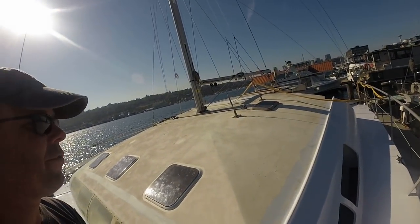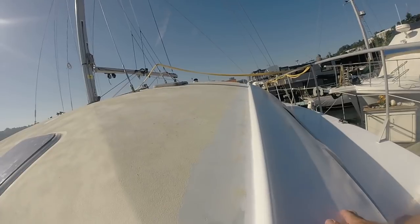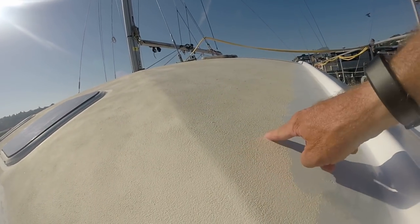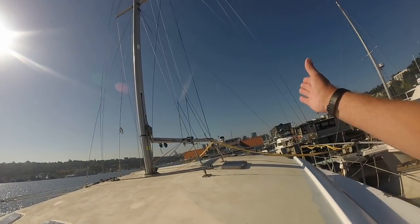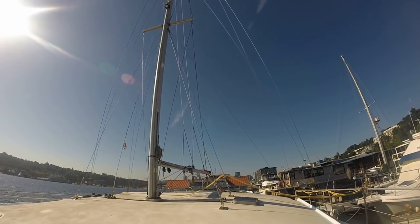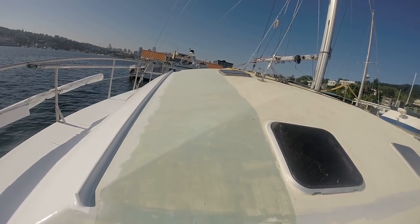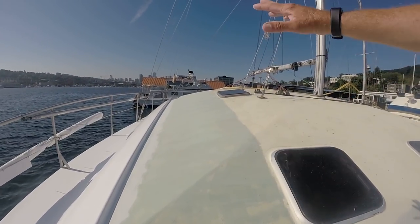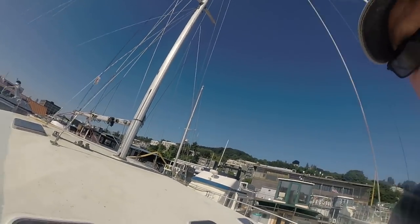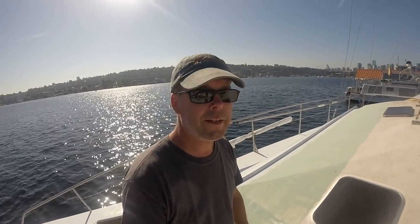You can see where I've started to fair. I just ran it wild over this a little bit, so this is the old deck and here's the first skim coat of fairing. I do two skim coats of fairing. I'm subdividing some of this out because it's just too much to do in one job. I'll sand this out today and skim it one more time, sand it out, do the same thing on the other side and paint. That way it only leaves about 250 square feet up here to do. I'll just keep chipping away at it until it's done.